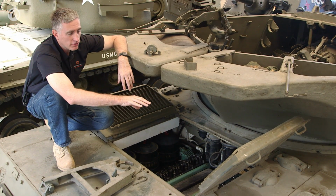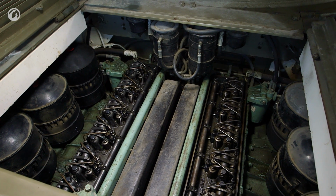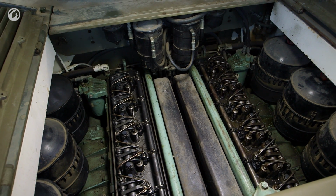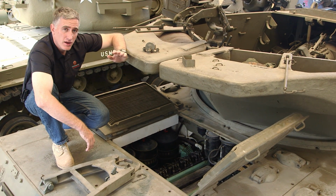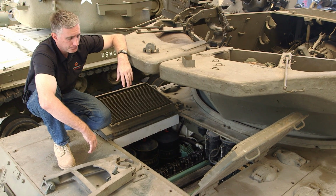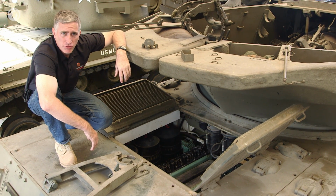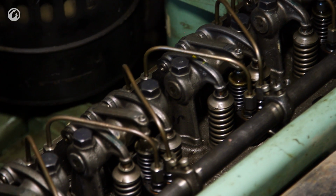On the outside, you can see that there are 3 ports per side for diesel, oil, and water. The engines themselves. It is a General Motors Model 6046. They are twin 6-cylinder, 2-cycle diesels, water-cooled of course. Combined total, 375 horsepower, 2100 RPM. Each engine is 425 cubic inches. This would be enough to tootle the vehicle along at 30 miles an hour in a sprint. The sustained speed, according to the manual, is 25 miles an hour.